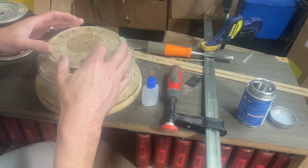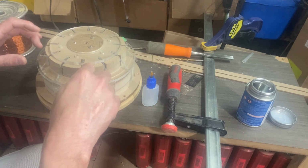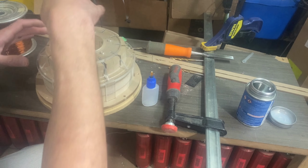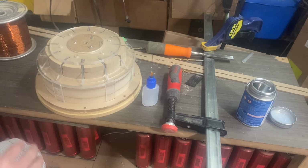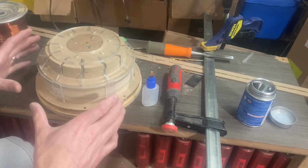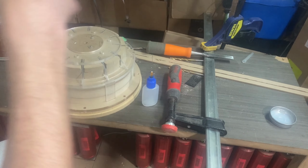We're going to put this on so that each mounting hole is between every second spoke, because there's 12 spokes and six holes. Then we're going to tack it at each corner with the glue and then pull it apart and re-glue it. Once it's had an opportunity to 80% cure, which is about 3 minutes, we are going to pull it off the negative and glue it from the top. It should hold pretty solid just with the 80%. But here we go.